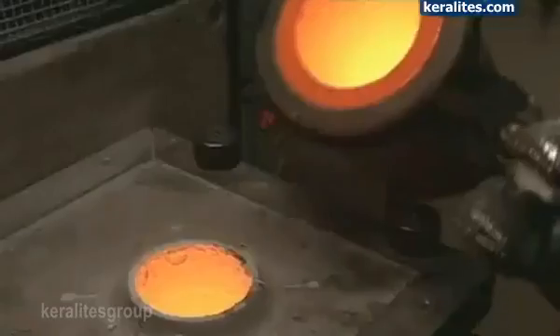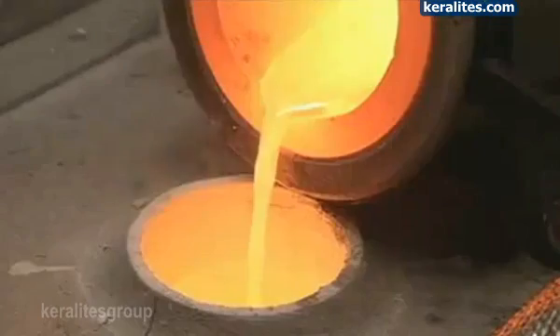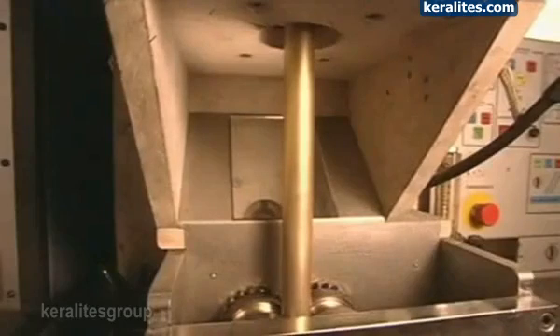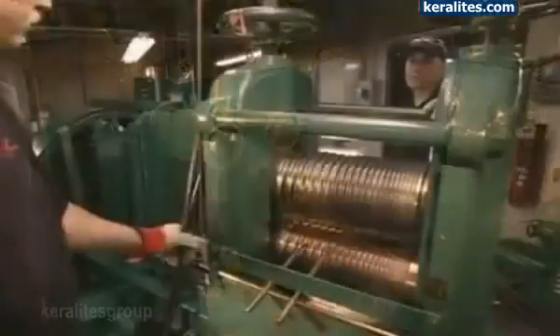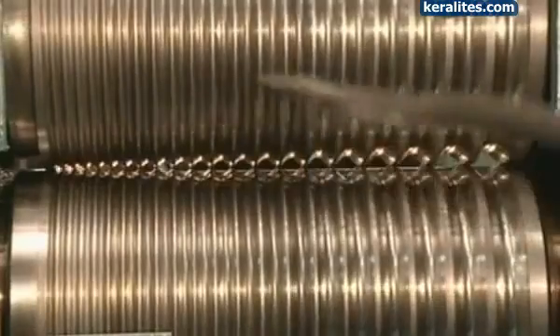The molten alloy is poured into a casting machine. Water cools the metal to around 370 degrees Celsius, solidifying it. The metal passes through a round die, which shapes it into a golden rod that's nearly 2 metres long. After the rod is cut in half, it's passed through what's known as a breakdown mill. The machine reshapes the rod from circular to square, so it will be easier to stretch.